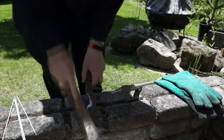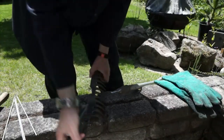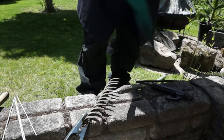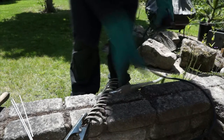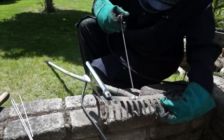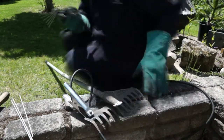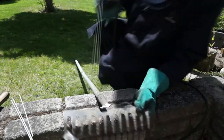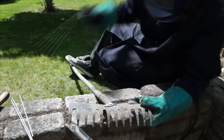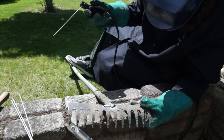It's all clean now so I'm going to grab the welder and plug it all in. I'm going to use electrode positive on the arc welder setting, because it means there will be a little bit more heat in the electrode, which means it will deposit metal faster and shouldn't melt through the sheet metal of the rake itself, as it's quite thin — that's what I had problems with last time; I burnt lots of holes in it. The metal is only about a mil thick, so based on a maximum of around 35 to 40 amps, I'm just going to have the welder set nice and low. The electrode is probably about the thickness of the steel, so hopefully it should be just the right size.